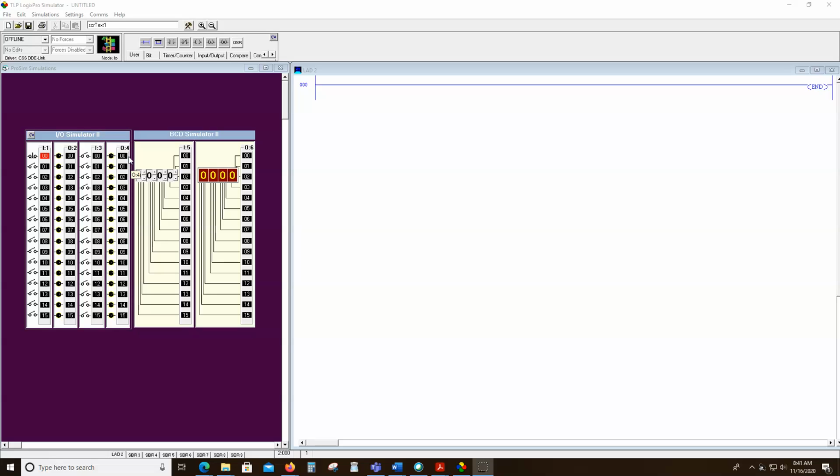So we have different types of switches. Some of those are limit switches where they're physically moved by something coming in contact with it. Some of them are proximity switches where they're not physically moved, but if something gets nearby it, it will cut on. One example of a proximity switch is when you walk to Walmart and the door opens automatically. There's some type of proximity switch that saw you there. You didn't touch it, you didn't press a button, but the door opened. It performed an output based on an input. And that's all these PLCs are doing.